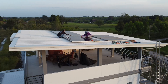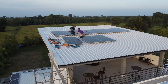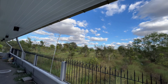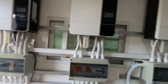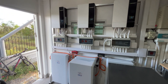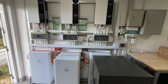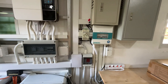I didn't need more power in the middle of the day as I was going for off-grid. The sun comes from the east in the morning, so I have panels on the east side, panels over the west, and even some panels on the north side — really trying to maximize the time the house runs on solar and minimize battery usage.